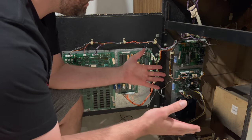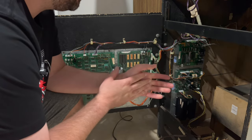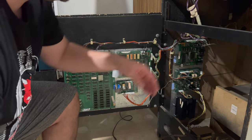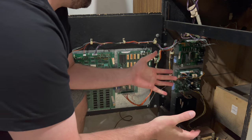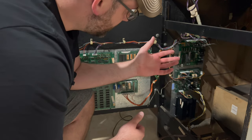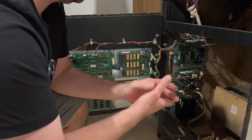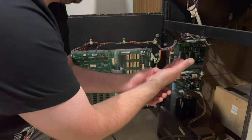This intermittent sound issue I'm assuming is coming from the soundboard. The soundboard is basically a separate computer that operates independently from everything else. It's got its own CPU, a PIA chip which is known for causing problems, some RAM, and a ROM chip that has the game sounds. I've tried replacing a bunch of different things to no avail. I've recapped it and replaced the transistor. It's got this test switch — when it's in this bad state, I can often press that switch a whole bunch of times and essentially trigger it back into playing the correct sounds, which is weird. I tried replacing that momentary switch. That didn't help.